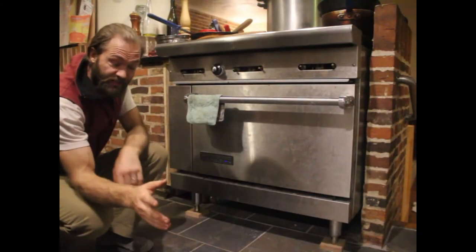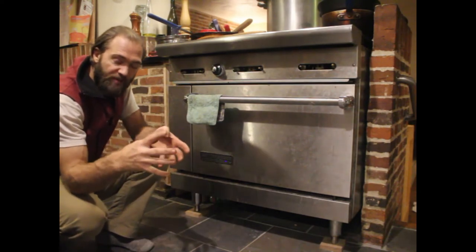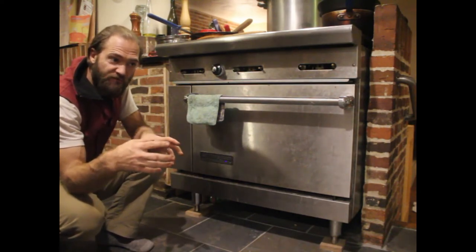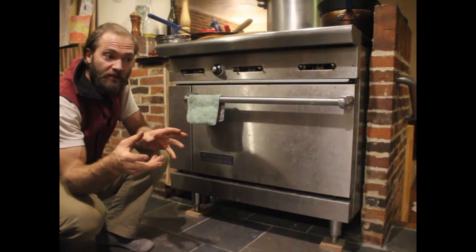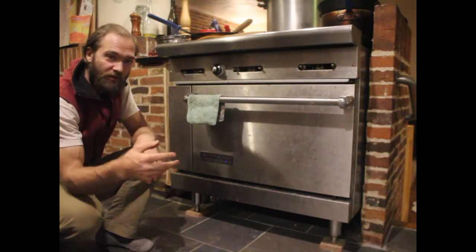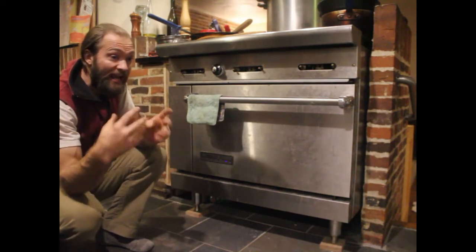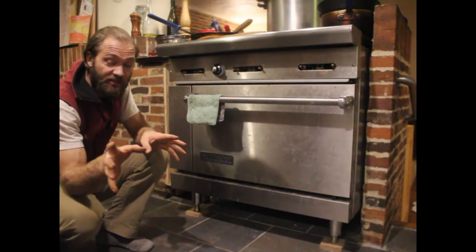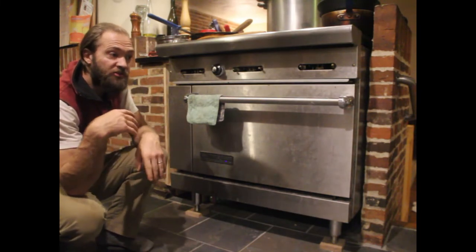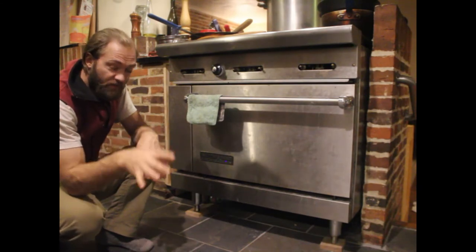Okay, so one website, the official website, says that the soles are baked at 100 degrees Celsius for a few minutes. And then I found a newspaper or a magazine article that said they went inside the factory, and on that tour, they said they were baked at 80 degrees Celsius for 10 minutes, and then left to cool at around 70 degrees for 24 to 48 hours.